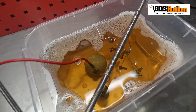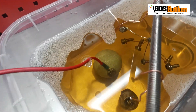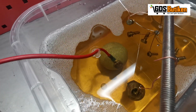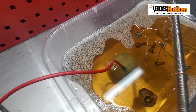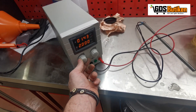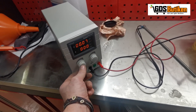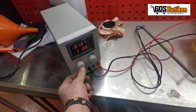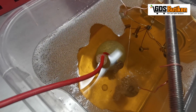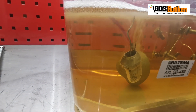All the bolts are hanging in the water — the copper wire is hanging around the threaded bar and the wheel nut is down there on the copper wire too. Nothing is touching the zinc ball, which is good. We turn the power on. At the moment it's set to 2 amps which is quite high. One bolt is bubbling quite hard — it's basically just reacting — so we're going to turn the amps down a little bit.